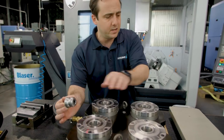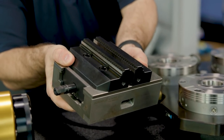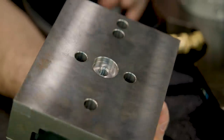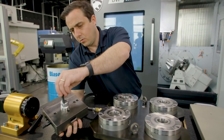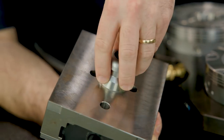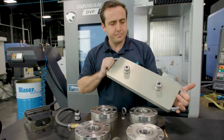This is one of our clamping pins that can go into any vise, pallet, fixturing, or directly into your workpiece. This is one of our standard vises — the KSC 125 160 grip vise. All of our vises have that standard preparation for one of our clamping pins. You can see that this clamping pin will just go right into that counterbored hole. We thread it in to the vise, and now this vise is compatible with the system — super simple.